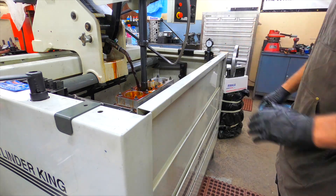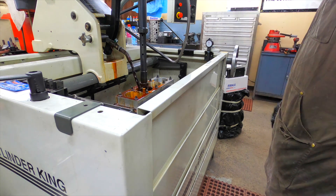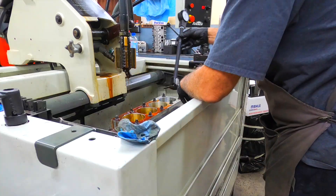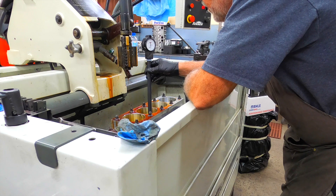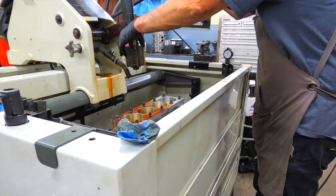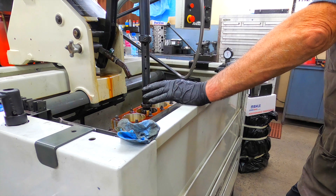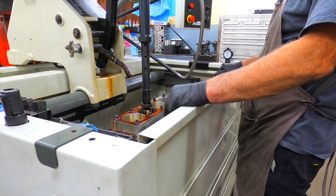I'm going to dress the stones a lot. It causes a lot of extra heat even though there's oil and honing fluid. I like stones over diamonds — the diamonds work okay, but it's like you take a piece of glass and run a diamond across it and it leaves a nice sharp cut groove. You take a stone and run across it and it scratches the glass, but it's a little smoother scratch. I guess there's pros and cons to either one — I've just had better luck with the stones.